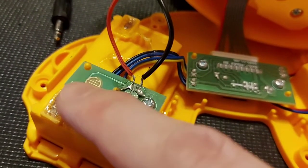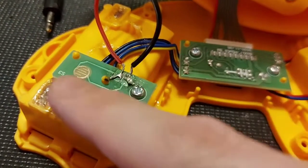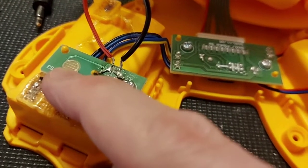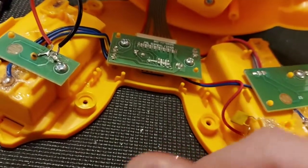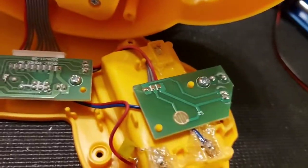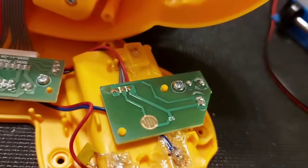Make sure that you leave this area alone. I found out after I did the adaptation that some other people have actually soldered right onto the switchboard and covered it, causing the toy to no longer function normally — it'll only work through the switch. This adaptation maintains the toy and keeps it in good shape if you ever want to hand it down, or for children in the home who want to activate it using the original switch as well.